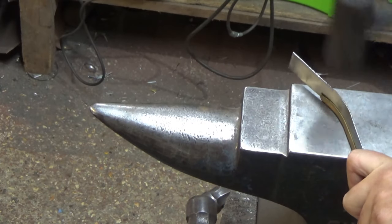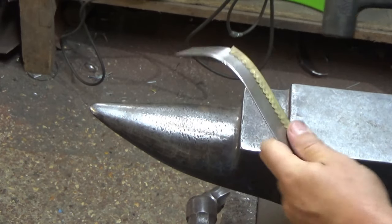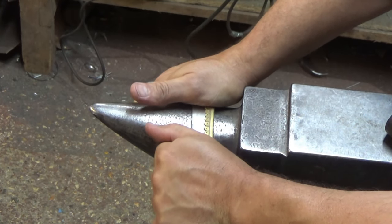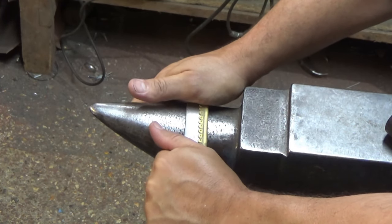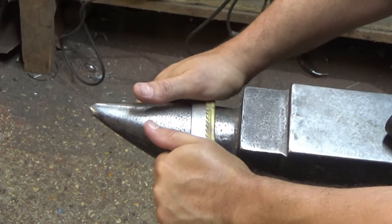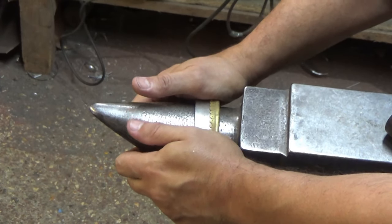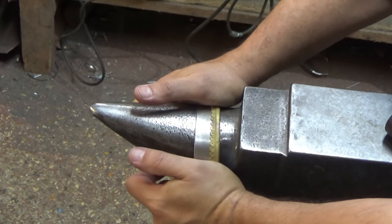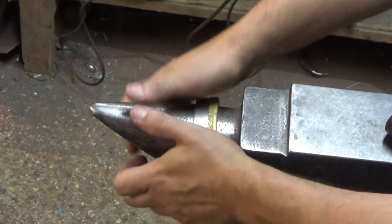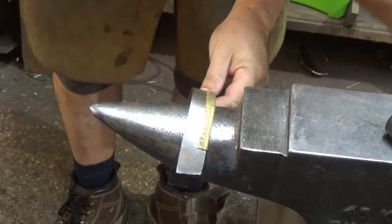Always return to make sure it's tapped on — don't do too much if it drifts off, because you're always going to be resetting this up. Now, because the steel is thin and the brass is annealed, you can start working it round by hand. I just found this to be a bit quicker, and sometimes I can do it forming it directly on the actual piece. When we get to the same spot here again, just tap that round.